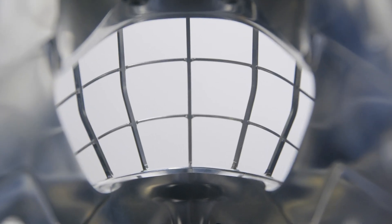This thing is awesome — the coolest part has to be this face mask right here. Those bars are 80 thousandths in diameter and about an inch and three-quarters long of purely unsupported aluminum. You'd think those things would chatter and vibrate like crazy with bad surface finish, but we actually figured out a really cool way to make those without any chatter at all.